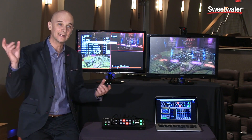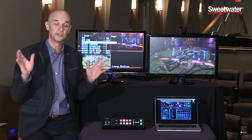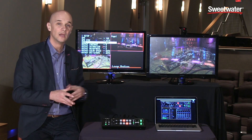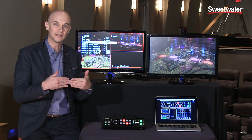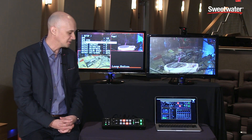In order to play HDCP content, the computer or Blu-ray device needs to get a key from your display device — your projector or monitor — confirming it's a legitimate output and the user isn't trying to copy the content. They do this handshake back and forth. Many switchers don't allow this handshake to happen, but with the V1HD you can confidently play those copy-protected sources and mix them with cameras, computers, or other HDCP-enabled sources with no issues whatsoever.